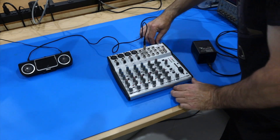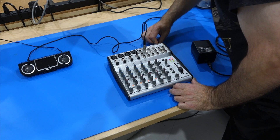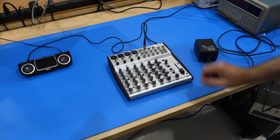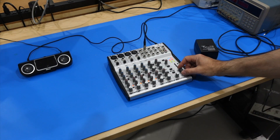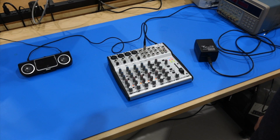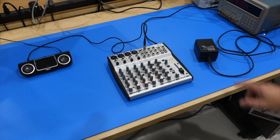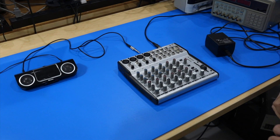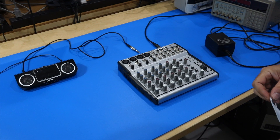Now it's really, really noisy. And as you can tell from the hum, it sounds like 60 Hertz hum. So my bet goes to a zapped filtering capacitor somewhere — maybe in the power supply, maybe in here.